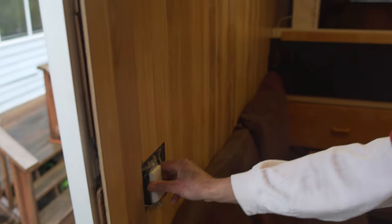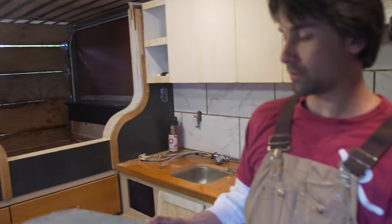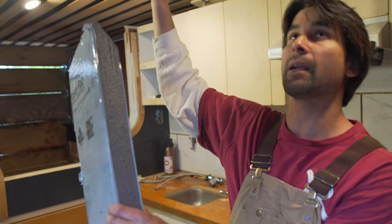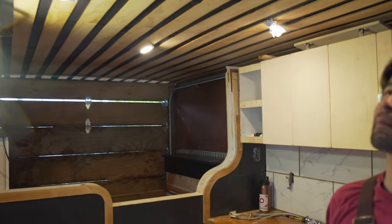It's all 12 volt, but I used a house box and house switch — it looked way nicer. All my lights are just regular pot lights; I ran that in the ceiling beforehand and then stuck foam up above. It's two-inch R10 value insulation. This black ceiling is what you see — I stuck it up and the slats I put up are holding the foam that I painted black, giving it a bit of contrast. I'm not sure that's gonna be my finished ceiling yet, but I'll do that for now.